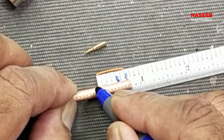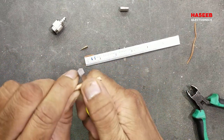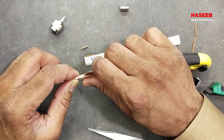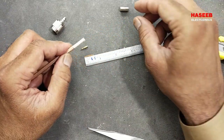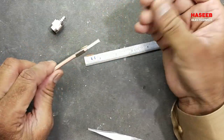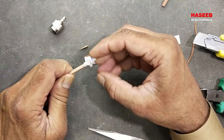Mark up to 2.6 — if you have a triple-cut stripper we can use that, otherwise use a knife. Slightly give a cut to remove the outer insulation and remove it. Now insert the ferrule. Slightly push the shielding back.